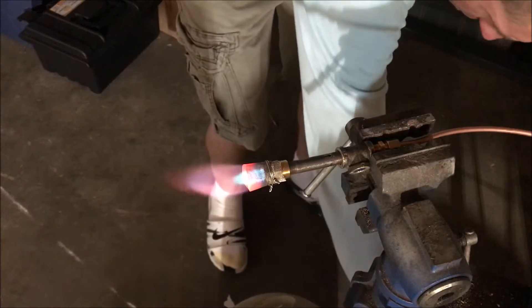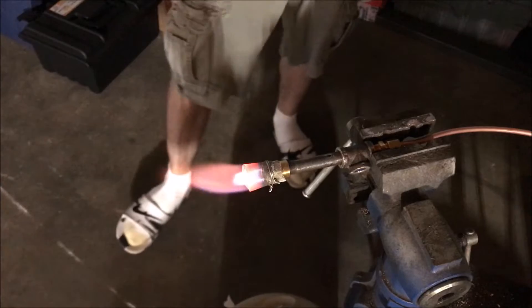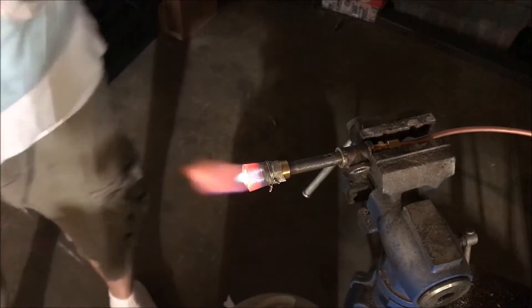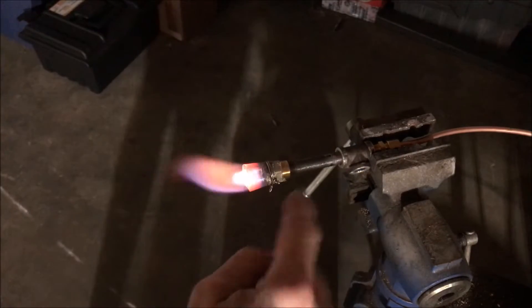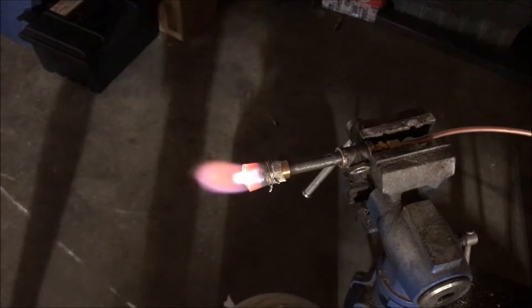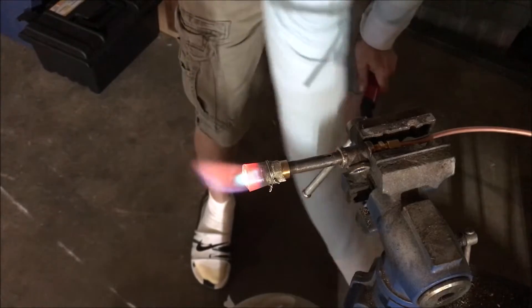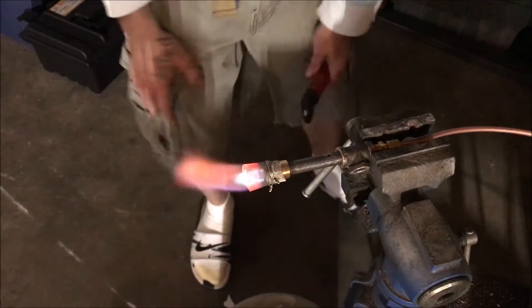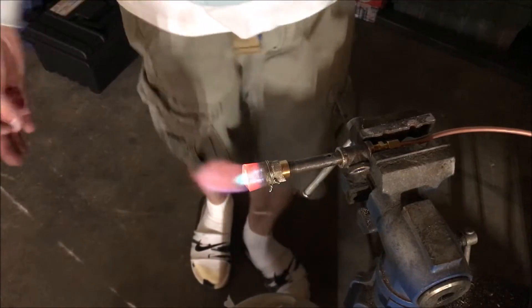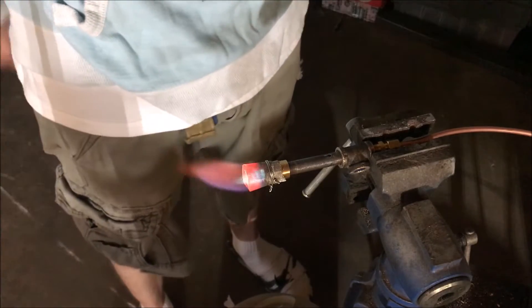Let's go to 255. Still normalizing - there's a lot of pressure built up in the hose and line. This spud was a 0.024 welding tip but I hammered it down to who knows what - obviously very low flow rate. So it takes a long time for the pressure built up in the hose to burn off. If you're set at 80 psi and you instantly try to turn it down to 50, it won't do it - it takes forever.